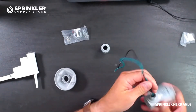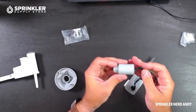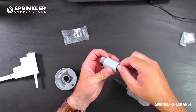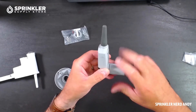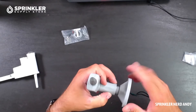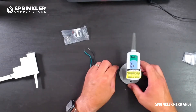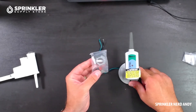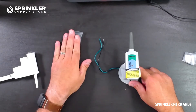We'll stick these two wires through the spacer, then mount the spacer to the receiver, and put it through to the mounting bracket. So if you need spacing, Hunter allows for that as well. You'll run your wires out the side, and then use two screws that come included in the little bag of hardware. There are two wire connectors, and there are also mounts for drywall — if you're mounting this on drywall you can use the included drywall anchors.